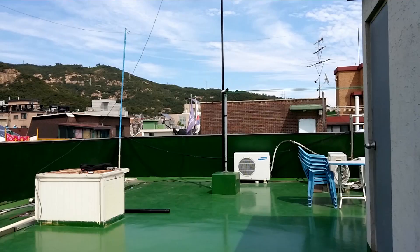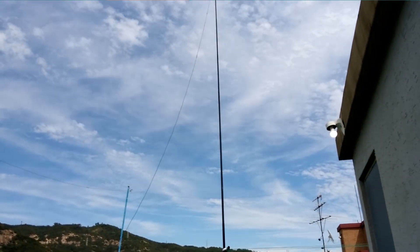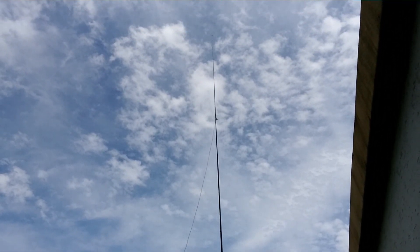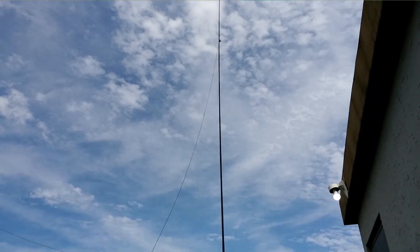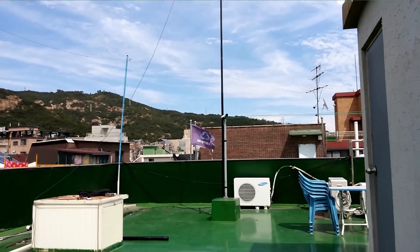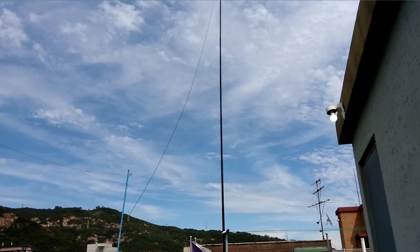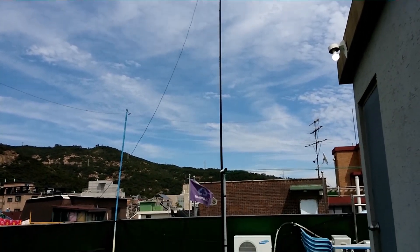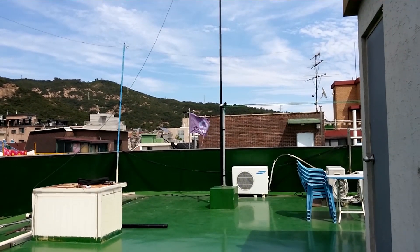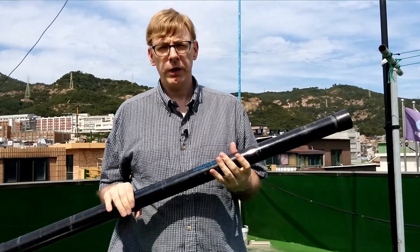Here it is — I put it up now, and you can see as I tilt it up, it goes up quite a ways into the sky. You can just see the top of it up there. The velcro strips are good enough to hold it, but you'll also notice the feed line comes off at a bit of an angle. You want to pull that feed line off at as wide of an angle as you can so it doesn't interact. There's probably some interaction, but if it's pulled about this far, I found there isn't a lot to worry about.